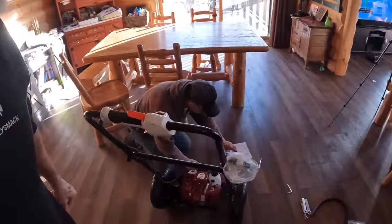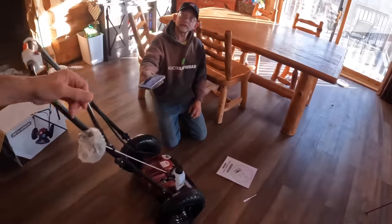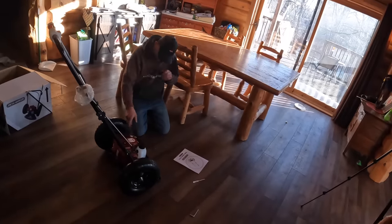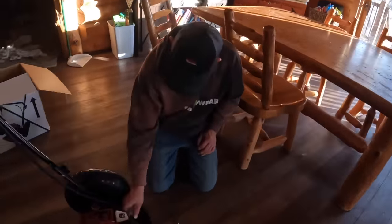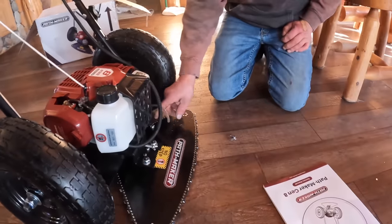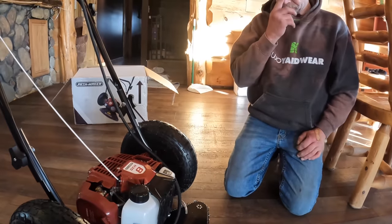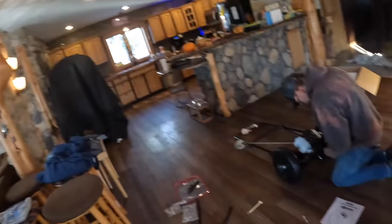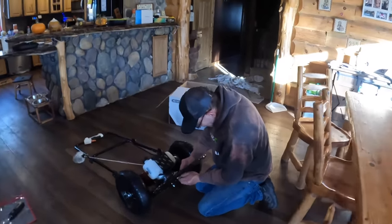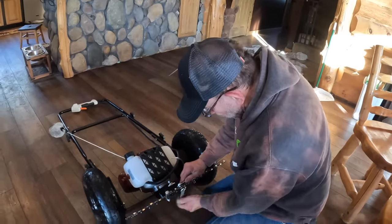Okay. I gotta take this apart, but they don't want the chain on there when you first initially start it. Why is that? Because they want you to get the oil primed to the bar, because the oil's gotta be run through the hose. Yeah. And they want that on the bar before you put the chain on. You've always kind of just led and followed along instructions, haven't you, Frankie? Right, yeah. Why's that? I put them together wrong too many times.